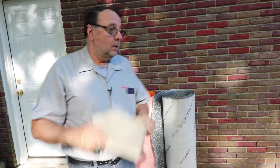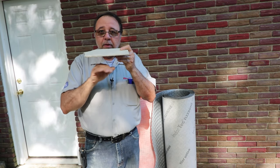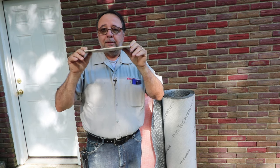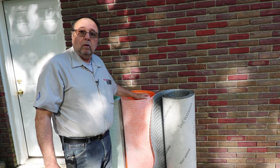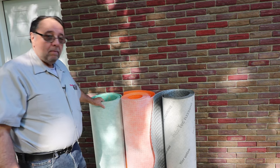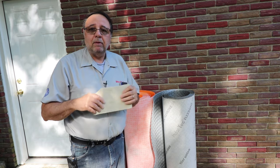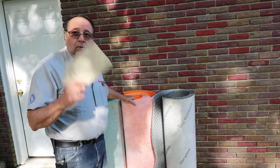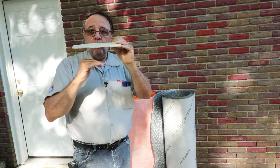So what's the difference? Besides the obvious fact that cement board is rigid and uncoupling membranes are flexible, cement board will not protect you from the small movements that are under the floor. Don't get me wrong — I've installed thousands upon thousands of square feet of this product over the years. The Schluter Ditra — the orange one — is the original uncoupling membrane that Schluter invented, and now all other manufacturers like Ardex, Mapei, Laticrete, and Custom have uncoupling membranes too.